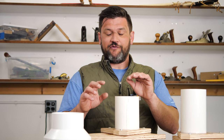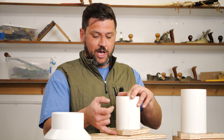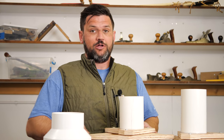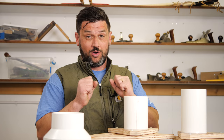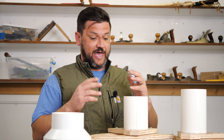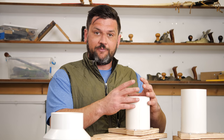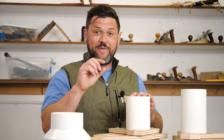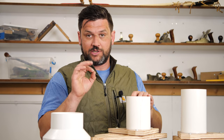Quickly, Jonathan from the future here. As I was editing this video, I realized I didn't say why I had the gap here with the washers. And the reason is just for ease of opening and closing. Without them, it's just way too tight. And yeah, you would have zero potential of any air gap, but without it, it's just too hard to crank on this thing. So that's why I overcame that with the interior mounting of the pipe, so it goes all the way down past this piece and completely shuts off that gap when the dust collection is open.